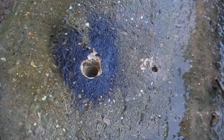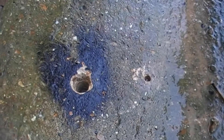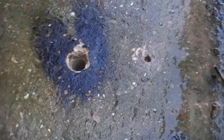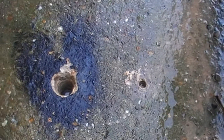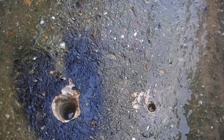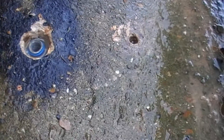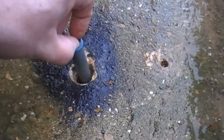Okay, that's my first hole. Full of water when I drilled it so I've got a real sticky mess coming out of it where all the dust sort of coagulated. So what I did was rinse it out with water, give it a good rinse. Got a leaf blower, blow it out, and try and get as much water out of it as I could. It's got a bit in the bottom. It says apparently I can use this in wet environments so it's not too bad, and the anchor drops in there. There's some water around it.